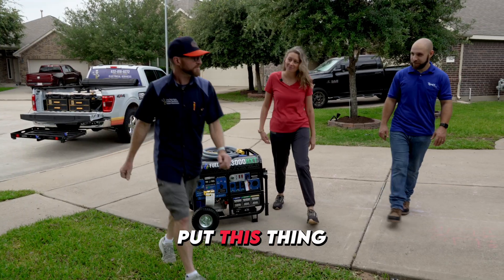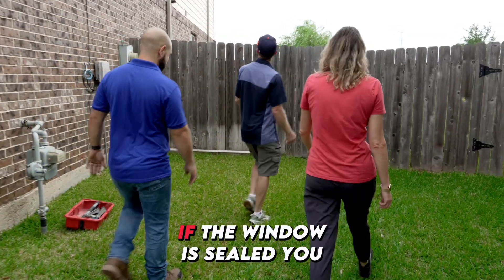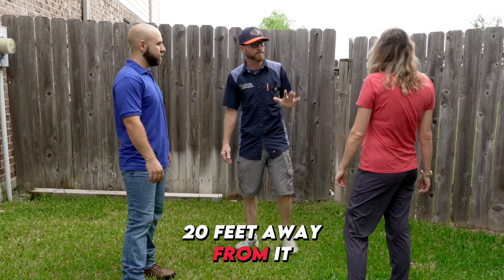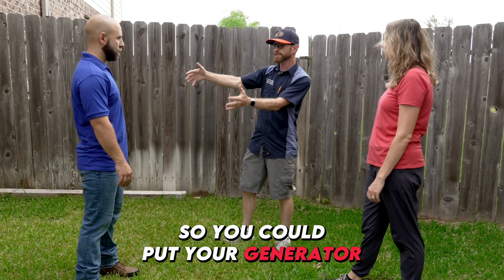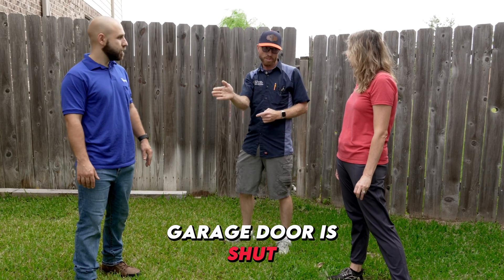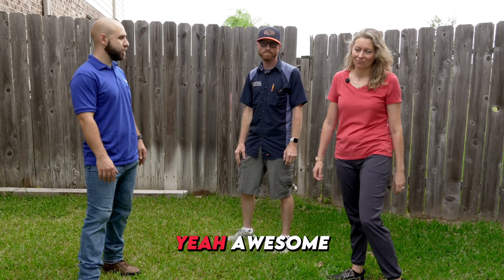Let's figure out where we're going to put this thing. You basically just need to look at where your windows are. If the window is sealed, you can be pretty close to it. But if it's an unsealed window, like your neighbor's back over there, you need to be at least 20 feet away. Your bathroom window back here is sealed, so you could put the generator in front of or behind the fence. If you want to put it in the driveway, just make sure the garage door is shut. You can pretty much put it anywhere in this area — just wheel it right out.